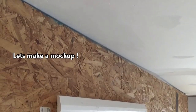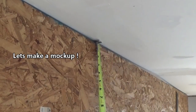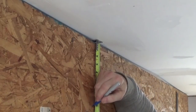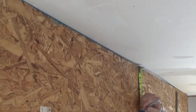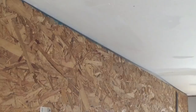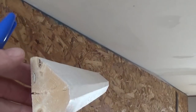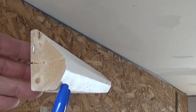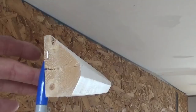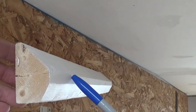It adds more light — it's kind of hard to represent that on video. Here's how I did it: I took a two-by-three and cut a profile into it to mount the cove molding, the trim, and the lights. Two-by-three might sound pretty tacky for the base molding, but it's perfectly suitable since less than one inch of it is actually going to be exposed. The upper edge is cut at 45 degrees — that's where the lights will go — and this is a 22-degree edge that will be exposed.